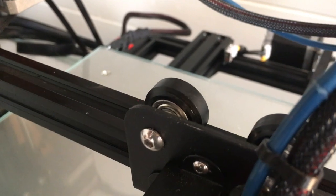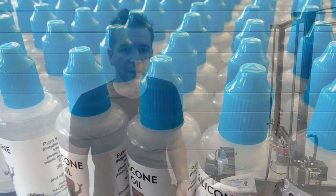Our next consideration was that 3D printers have drive belts, V-slot wheels and other parts which are made from plastics and rubber, which are not compatible with hydrocarbon oils. Without lubrication these parts do wear, especially these V-slot wheels, so we use this silicone oil.